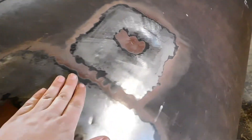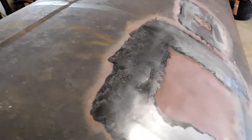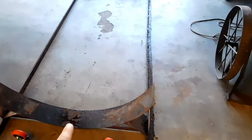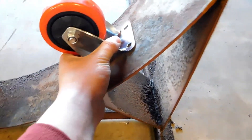One down and three more to go. We now officially have all four patches in and everything came out really good. There's a little bit of filling to do, but I think by the time I hit these with some primer filler and paint everything should be looking good. Now moving on to how to construct these tanks as complete wheels. This is the frame that was on the underside of the tank when it was all one piece. I'm going to take these casters and weld them somewhere in here.